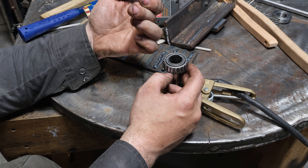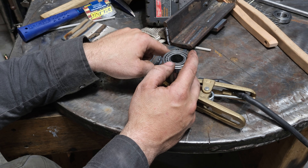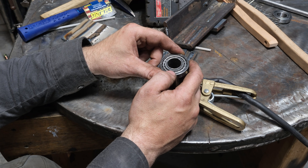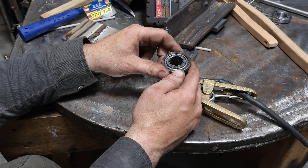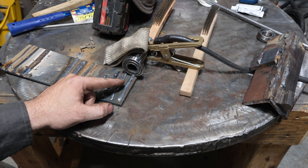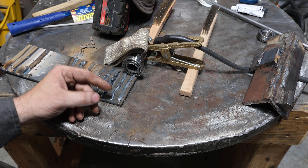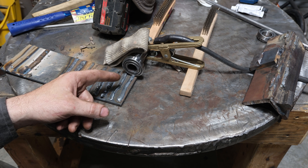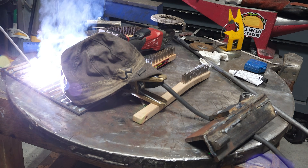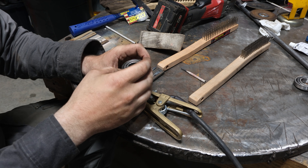By the look of it, I don't see any hugely detrimental spots. So now I'm going to clamp everything up again and run another single pass, but this time with a little less preload — I'll roll it so the race is touching the top of one bead rather than two beads, giving it more or less one path directly into the race for a ground. I took away the preload; there's still weight on it so it won't really move. Let's run another pass and see what happens.